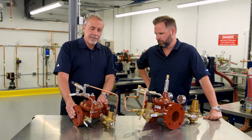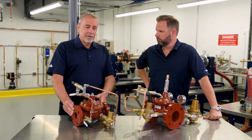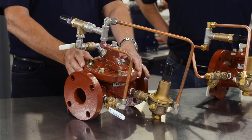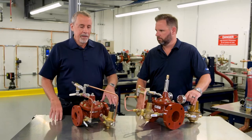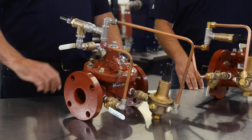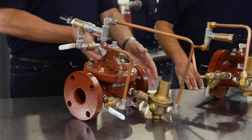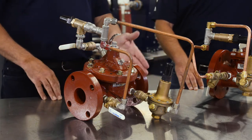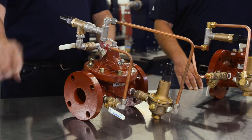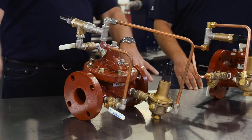Automatic control valves, or ACVs, can look complicated or scary, but really they're not. It's a simple diaphragm valve. Basically what it's going to do is if you have a higher upstream pressure — let's say 100 psi — and in my building I want 60 psi, that's the demand. So regardless of pressure upstream or how much water I'm using in the building, I want 60 psi all day long. I've got to be code — I can't blow out hot water heaters or anything like that. So it takes high pressure and maintains a low pressure, regardless of how much water.